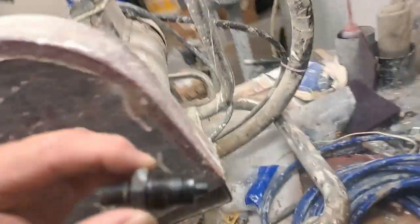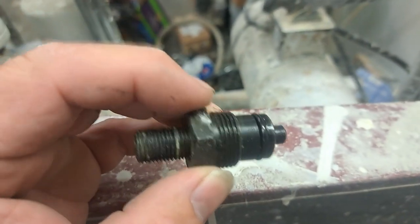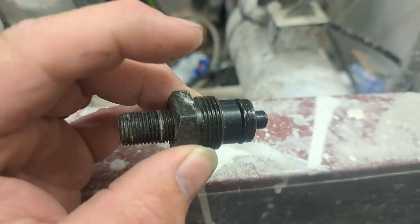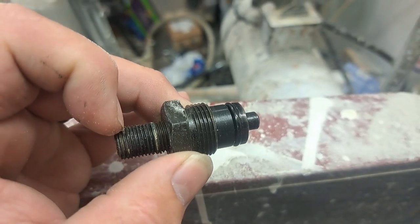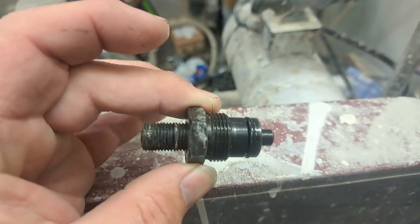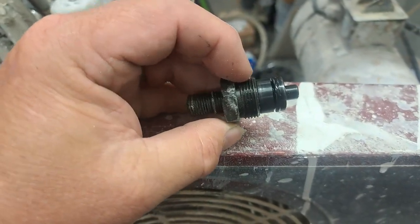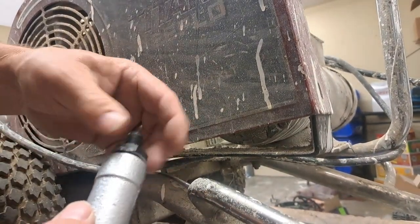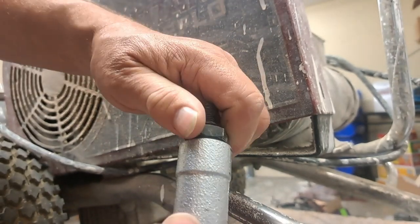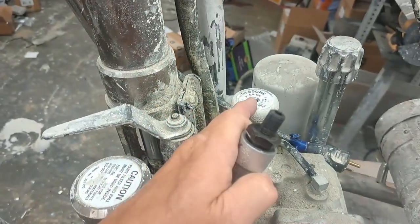Once you have just this, you can set this with the knob on it in the vise — put the vise on the knob and put your wrench here, and you'll unscrew this from the knob. I don't usually like doing this because it takes a lot of effort and it's very easy to damage your parts. But once you've got the knob off, you're going to put this back on. When you put this back on when you're done, put it on tight and make sure everything's still inside. The set screw is out.